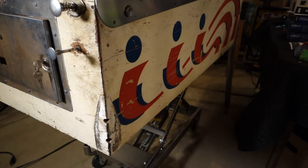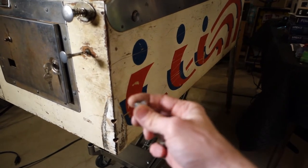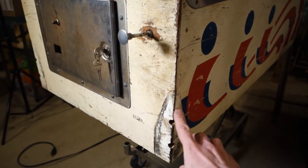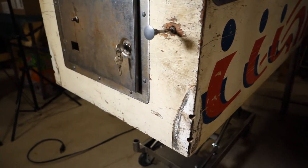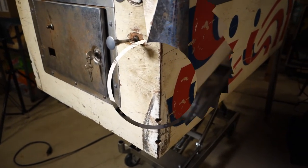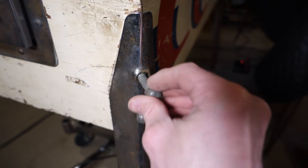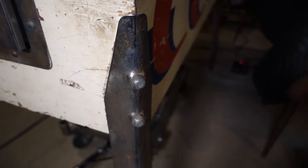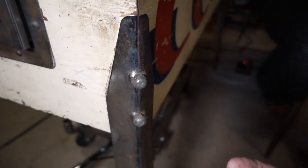You just thread one on, run it down, and when you go to put the legs on, the bolts will go on much easier — they won't cross-thread or get jammed up, and when you take it apart it'll be much easier too. It takes a little extra time but it's well worth it. Here we are installing the bolt — and this is the reason I do the extra work. The bolt goes in, finds its home right away, and just goes in beautifully. Sometimes even new bolts need this done. Tighten it down and you're done.